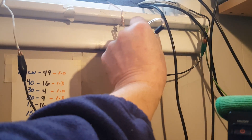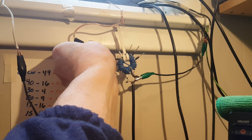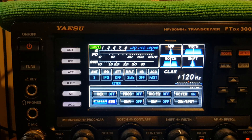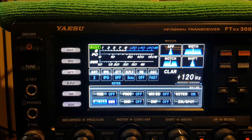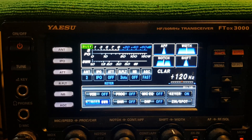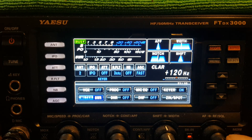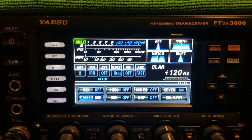Hang on, I'm going to pause. Things are going to get a little messy here. We're going from the 49:1 tap — let's try the 16:1 tap, I think that's the one I liked. I repositioned my phone and tapped on the SWR display area to try to make it focus better, and the colors completely changed — it's weird. This is not the camera to use for any kind of serious YouTube video, but regardless, let's see if the frequency is still clear. Okay, on the 49:1 tap we had our 'yay it's tunable' moment — I've changed to the 16:1 tap. Let's check the standing wave ratio.